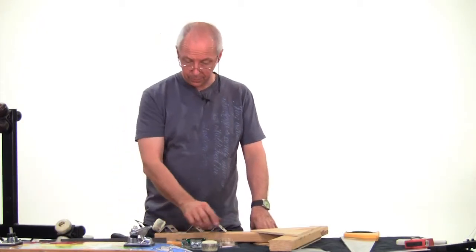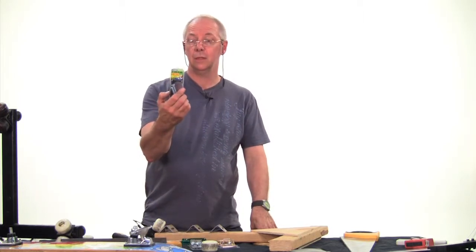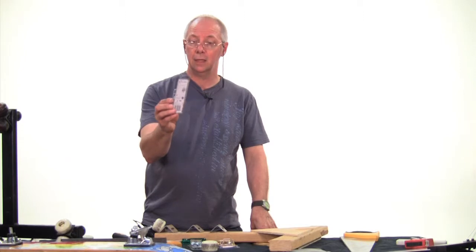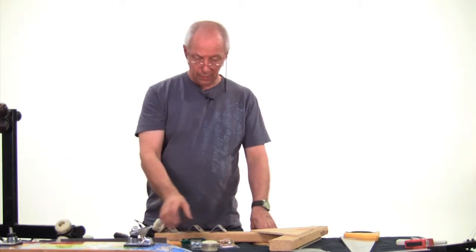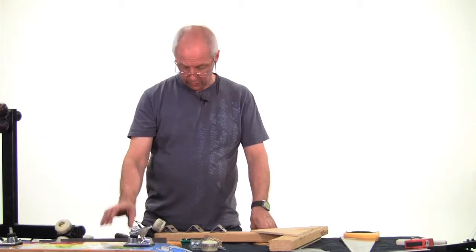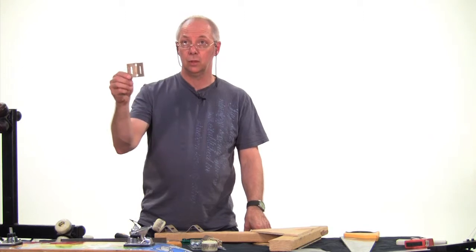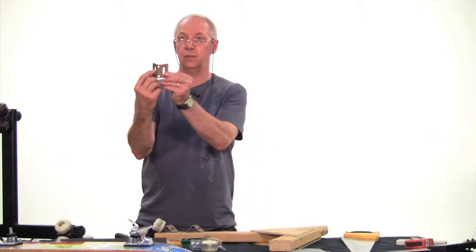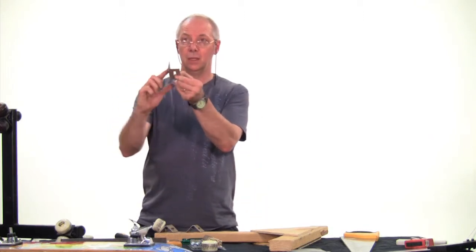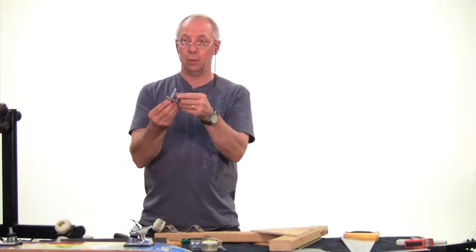Well, I've just got back from the hardware store, buying a few bolts. I bought some metric bolts. They're 8mm, 50mm in length. I bought packets of nuts, screws, plenty of extra nuts too, just to be on the safe side. I finally filed and drilled the holes. You may not be able to see, but I've actually filed the slots just in the middle, just big enough to be able to put the bolt through it, so it goes in without any problem now.